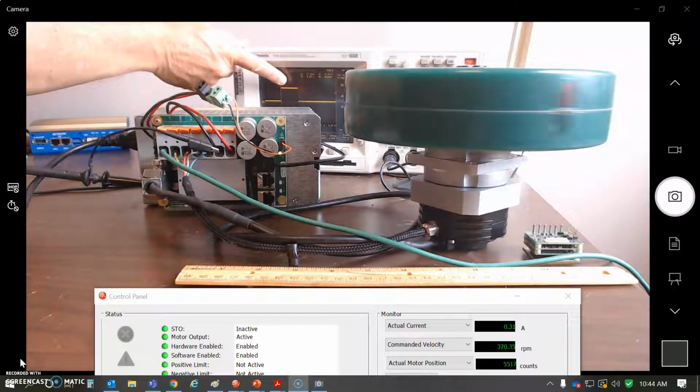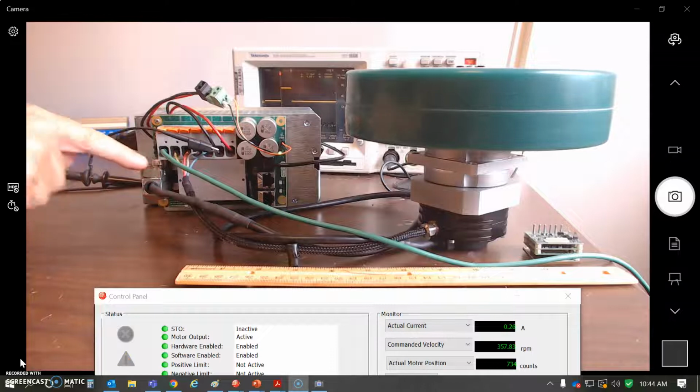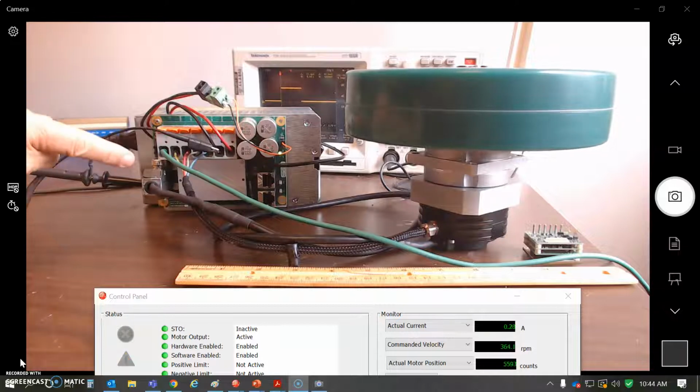I'm tracing the index here off of the Copley drive. That's an AEV module. This can do 50 amps continuously. So you could run, I don't know, maybe 30 amps for 10 seconds to go up a hill or a ramp or something. Or to get up to those top speeds to accelerate a mass.